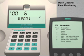The Multiranger we are using is a dual point model. However, in this application we only want to monitor the flow rate in one open channel. Therefore, we need to ensure that point number 2 is turned off. Press the Next Display key three times or until dash, dash appears in the Index Number field. Press the Up Arrow key twice until the Index Number field shows 0, 2. Press the 0 key followed by the Enter key to set point number 2 to the Out of Service Operation setting.